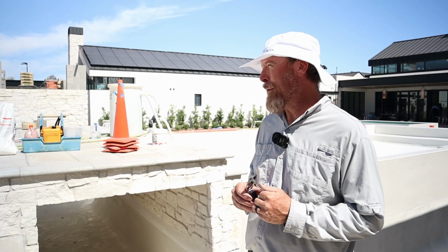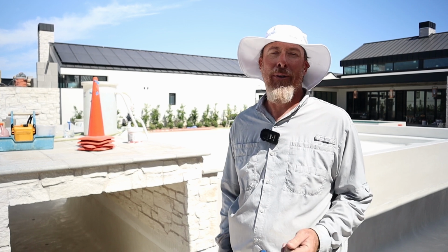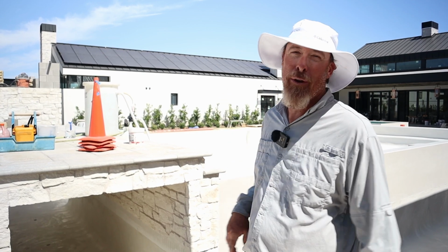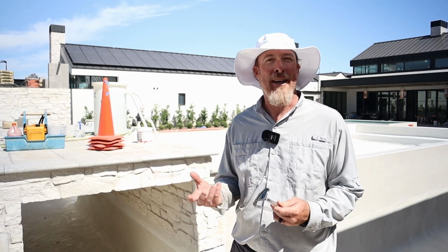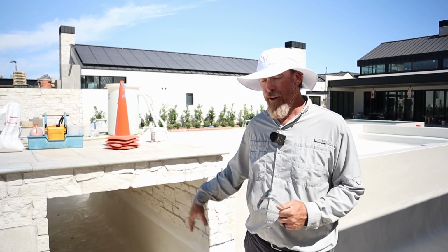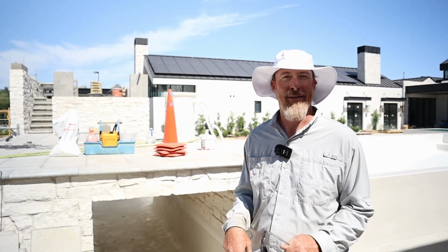Yeah, so 130,000 gallon pool here. One of the bigger pools we have on site that we do each year. We got basically a pool inside of a pool that's got a lazy river wrapped around it. The concept is we want to fill this thing as fast as we can, but we also want to take care of the surface. One of the things that these barrels allow us to do is, if we threw the hose in straight from the tap water from the city, it keeps the water naturally acidic, which helps keep the pipes clean. But for us, that can also pull the brand new interior surface that's here. It can pull the calcium out because the water is naturally acidic. It's not harmful, it'll just pull that calcium right out of the surface.